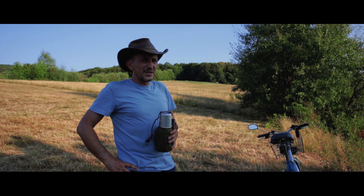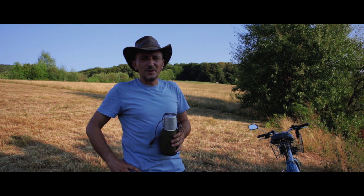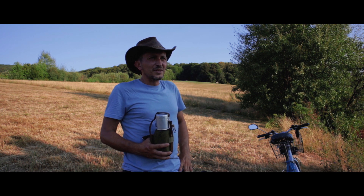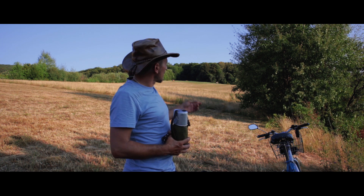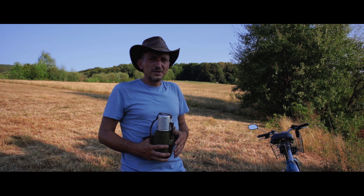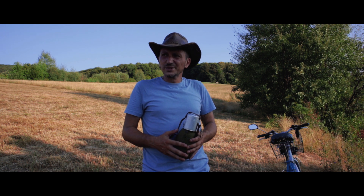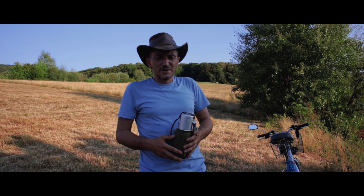I made it to this place where I wanted to try my first portable work on HF. I have this tree behind me, so I'm going to try to set up the half-wave end-fed wire in there, set it up, tune it because it's a brand new antenna, and then try to do some contacts on the 40 meters band and maybe 20 meters if I manage to get it to resonate well enough on both bands.